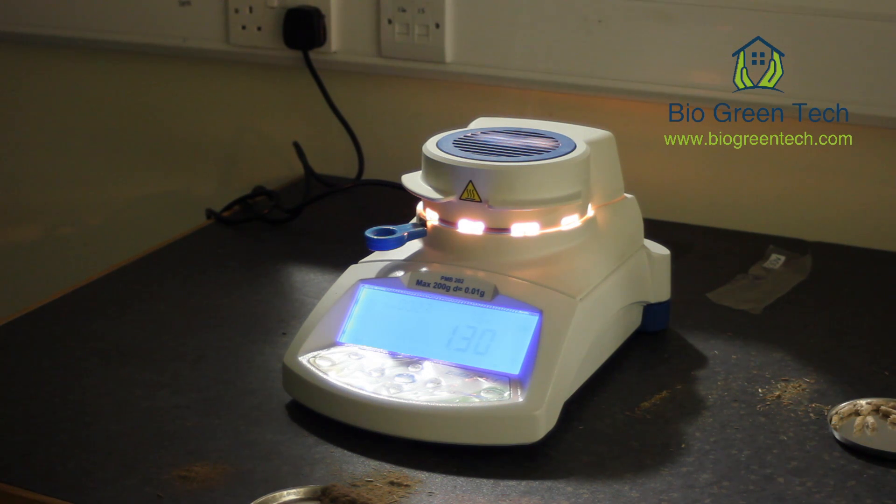And that's what we need to know from the dryer. We do a test of the material before it goes into the dryer, and a test of the moisture as it comes out of the dryer, so we know we're getting the optimum moisture in the material.